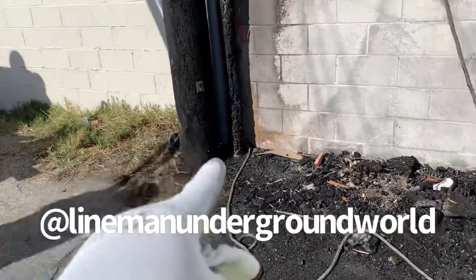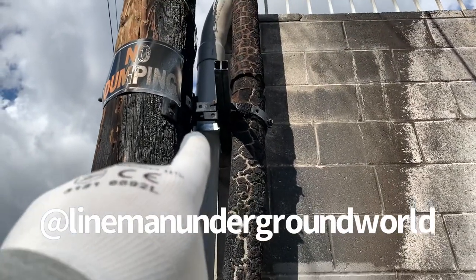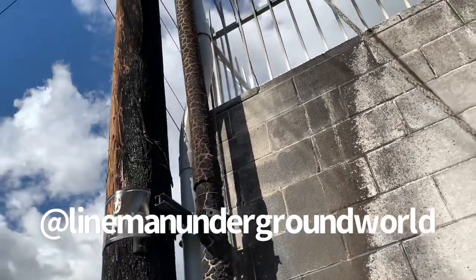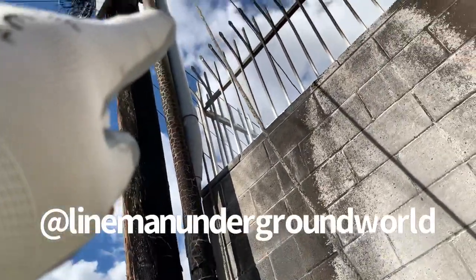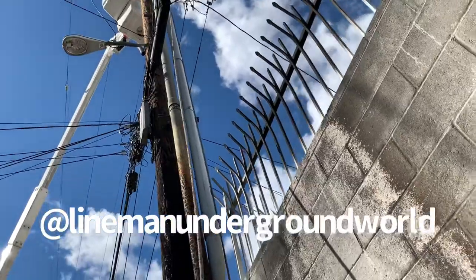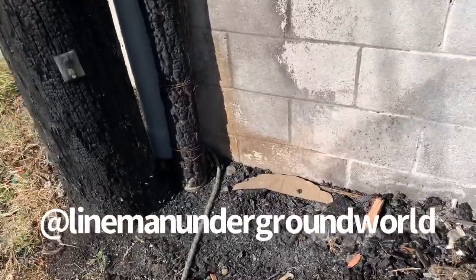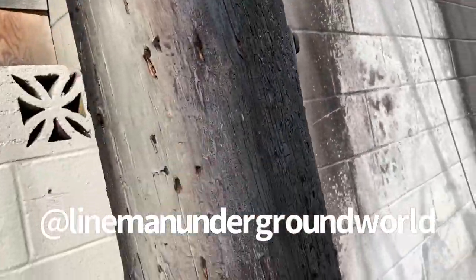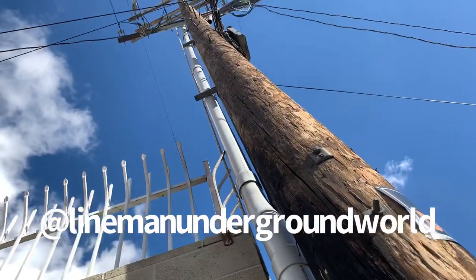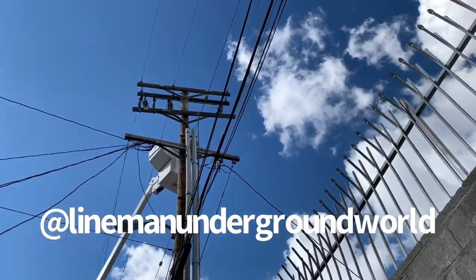All right, final recap: we're putting in a new riser, and it was on the back side, as you can see right here, so we had to bring it around the front side. We used 45s from the Dirt Dogs, and we brought it around the front and all the way up the pole. So it looks really nice, and like I said, we'll come back later and pull the cable in. But that's what you can do when you have it on the back side. Just bring it over with some 45s. All right, final eyeball, final strap, and that's it.